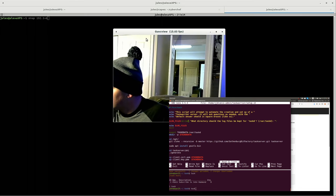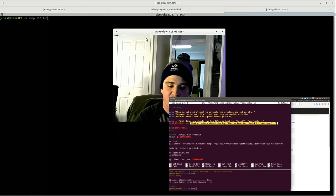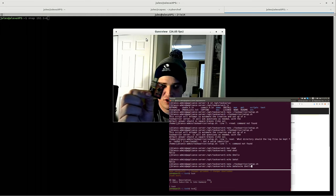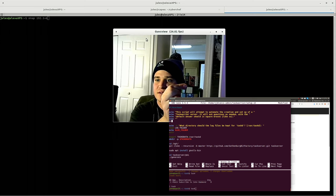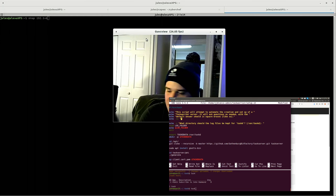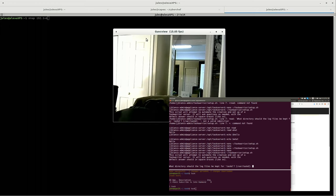What other hardware projects do I have going on right now? I'm building a localized positioning system out of these guys. So these are some boards that I built. Just had the PCBs made on OSH Park. Basically, they're using a chip made by a company called DecaWave, DWM1000s, with an Arduino Pro Mini on there. And what they do is, when you have two of the chips, they use ultra-wideband pulses, and they compare the phase difference to calculate time of flight between the RF signal bouncing between them. So they can measure distance to, I think, like 10 centimeter accuracy with RF. What else do I have going on? That's my only projects for the moment. Playing with some solid state relays too to control some stuff around the house, but anyway.